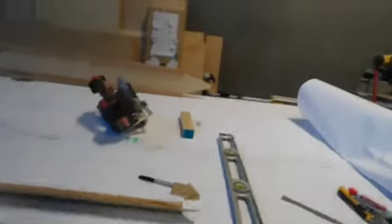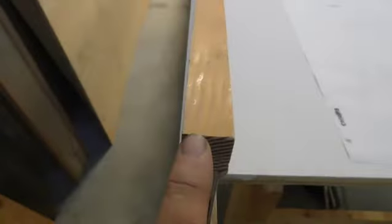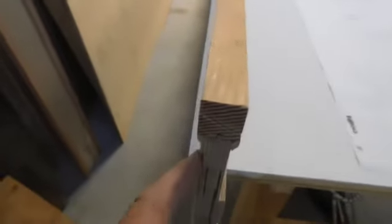One other little thing here, these are 1/2 inch, so 1/2 inch ply fits right in there, and we put it right in there for that blocking. Now there is one on the main spar, the block's right there that you put in. Now it calls for 1/2 inch as well, but you've got to remember this is 1 inch, and 1/2 inch and 1/2 inch is 1 inch, but you've got the 1/8 filler.